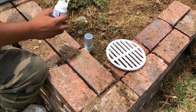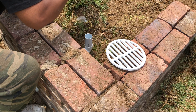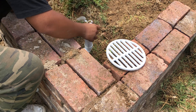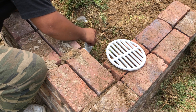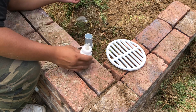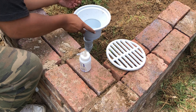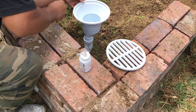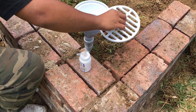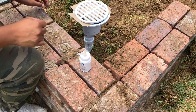This channel drain is simply a couple of PVC pipes connected with a 90-degree elbow, and then the gully drain which goes on top. The gully drain is fitted to a reducing unit that reduces from 110mm down to 50mm, which we used over here. You can use whatever size pipe you require, but 50 millimeters is more than adequate. We simply apply PVC glue to both sides, make sure it covers nicely, then set it and allow it to cure. We covered it up to ensure no dirt or debris gets in there whilst we're laying the soil and grass.